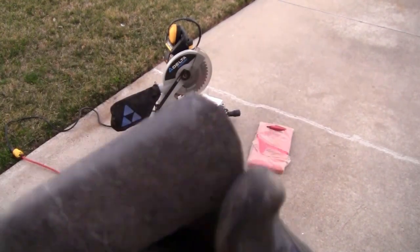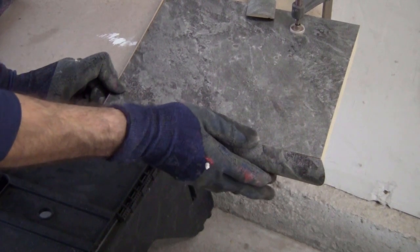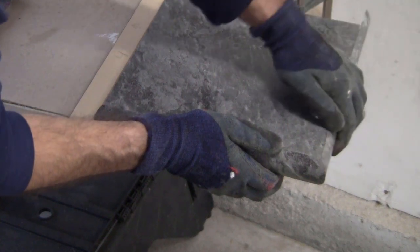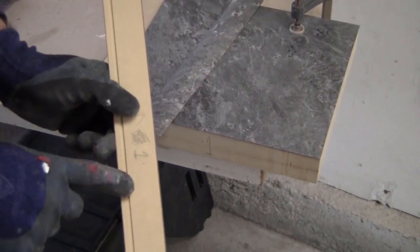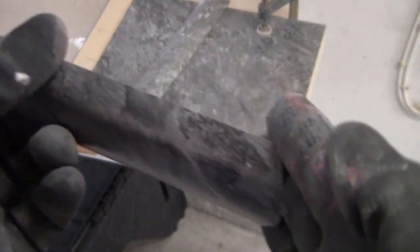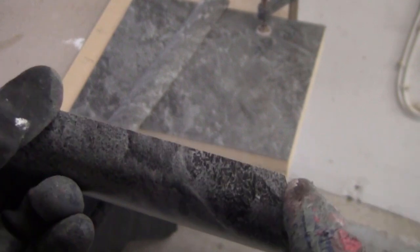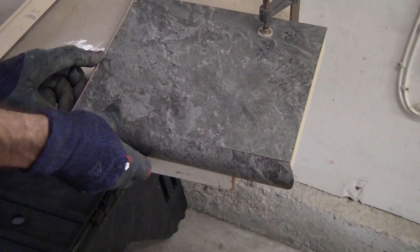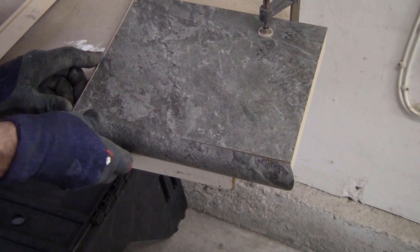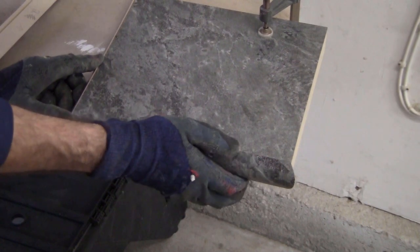Here's piece number one and this is where I made the pencil mark. I tried to keep shaving it down gently until I was into the pencil mark, and the cut produced is pretty clean. Let me double check — this piece is too long, so I need to take a smidgen off of piece number one. I pushed my piece up against the saw blade, put a little pressure on it, lifted the blade, turned it on, and when I came down it took off about a 32nd to a 16th of an inch. I think I was a little aggressive with that technique, but it's very very close.